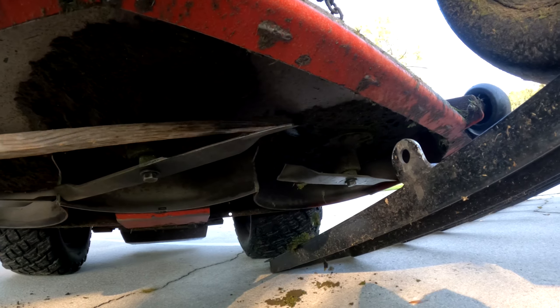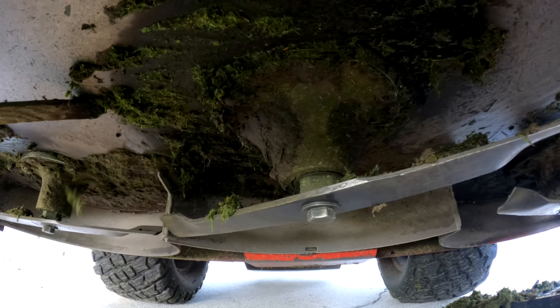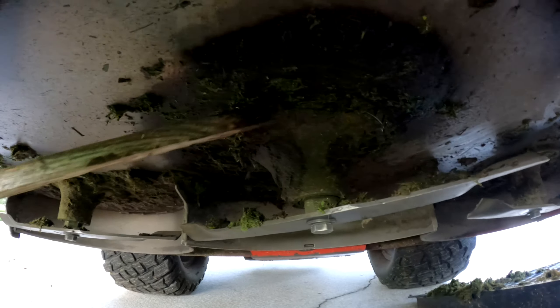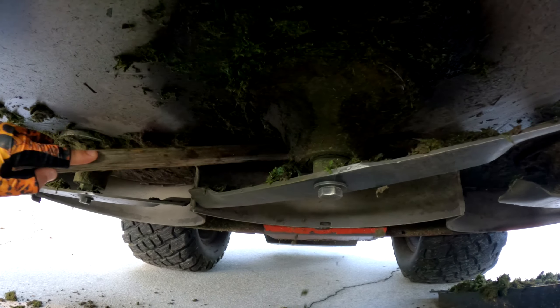This actually is not even that bad. I've had it where every single square inch of deck is covered with grass, so this is a much easier scraping session than a lot that I've had. This also doesn't have to be perfect — once you break a lot of these clumps up, some of this stuff will just fall out over time. I also will just blow the deck out while it's in this position as the last thing I do, and that helps get a lot of the little stuff left.